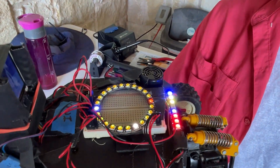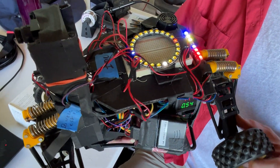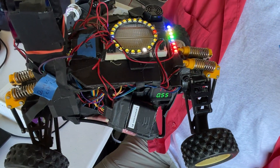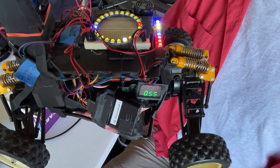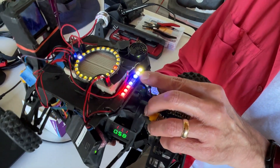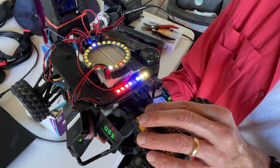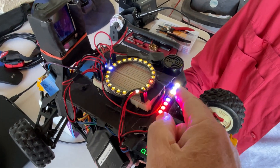The NeoPixel colors: white is compass north, blue is the front of the robot, red is the back — colors carried over from a hover sim project where robot orientation could change relative to the platform. Two yellow lights bracket the target heading. When the blue light is between the two yellows, the robot is aimed straight on its original heading. If blue is outside the yellows, it needs to steer — you can see the servo respond accordingly.